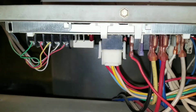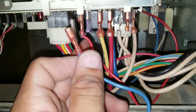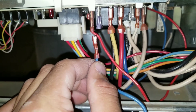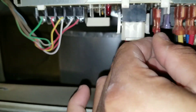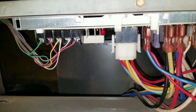Right now my board is not flashing because I removed the 24 volts coming from my transformer. We're going to plug our leads back in — I put one in already, now the second lead. As soon as I tie this in, I should get power to my board. As you can see, my board does have the necessary voltage.